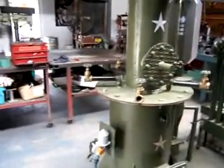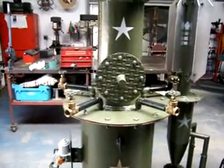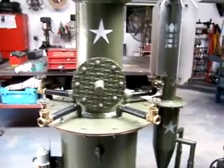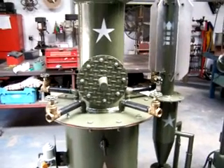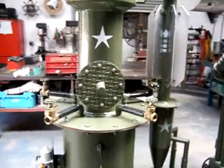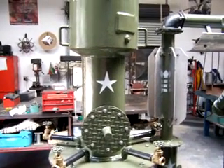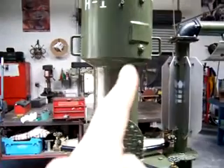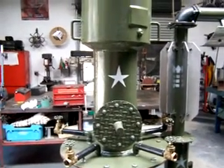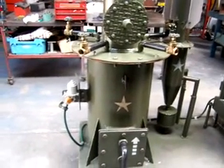This is a five-nozzle system. This thing here is an inspection port — it gives me the convenience of taking those bolts off, reaching down, and being able to change out the nozzles without ripping the whole gasifier apart. The wall thicknesses are about 5mm all the way around: the compressor body up top is 5mm, the tube with the star on it is 5mm, the barrel is 4mm which I had lying around for a long time, and the door is 9mm.